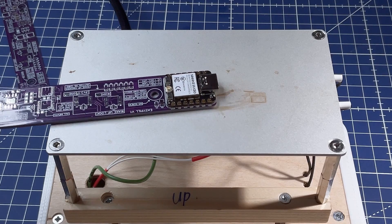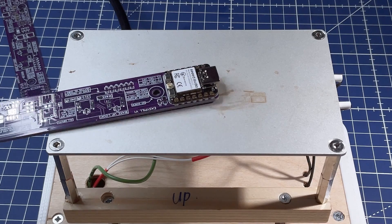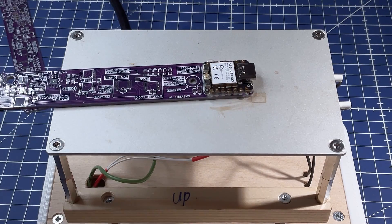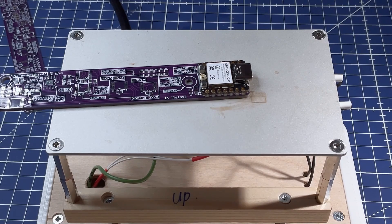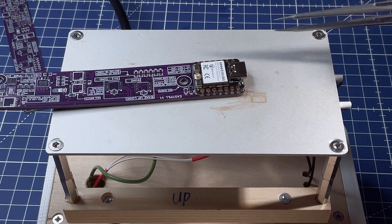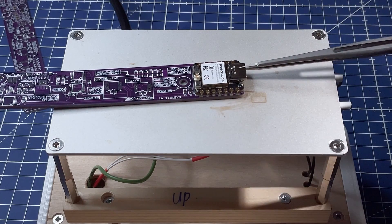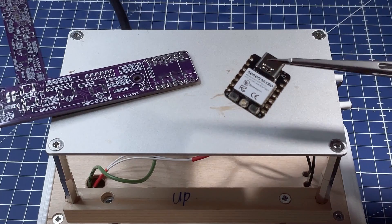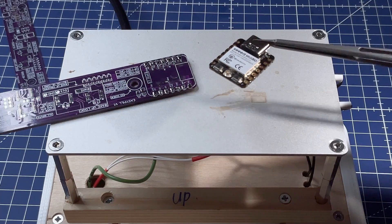Another great thing about a setup like this is desoldering. For example, with this ESP32 — if I used hot air I would probably blow off components from the ESP32 before actually desoldering it. But putting it on the hot plate, I can much more easily remove it without disturbing the other components. I heat up the perfboard, add some flux on the ESP32 pins, and at around 160 degrees I manage to remove the ESP32 without removing any of the other components — which would be much harder with a hot air gun.